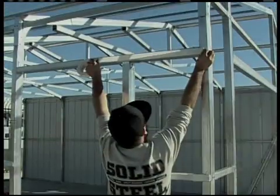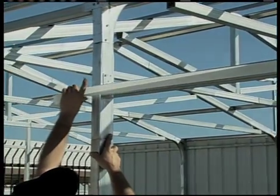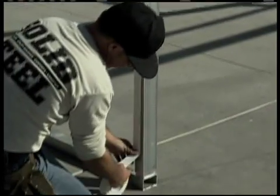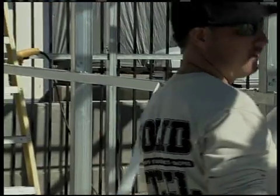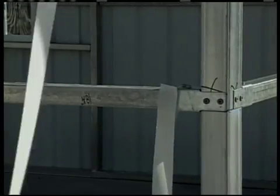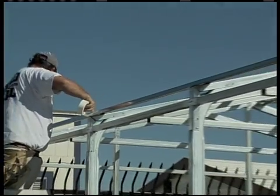It is held in place using the double-sided tape that was included in the purchase of the insulation. Adhere the double-sided tape to the two inch by three inch frame members. Also, it's a good idea to put some here and there on frame pieces just to make sure it stays up there until you get the exterior panels on, and to the top of the first purlin.